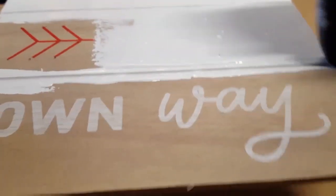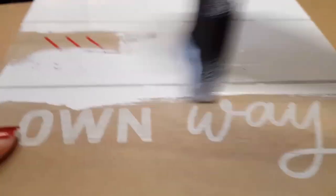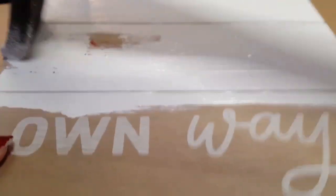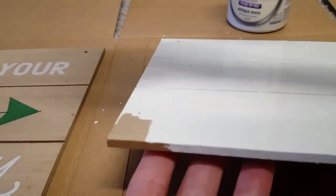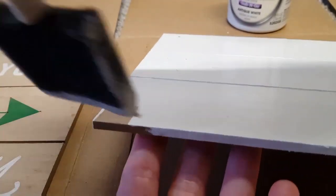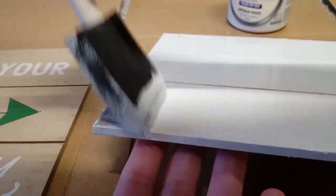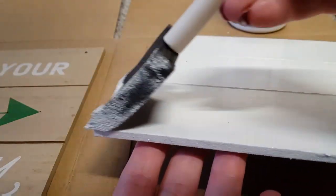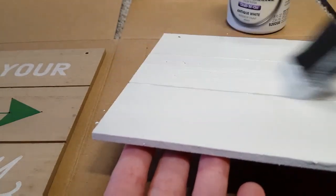You don't need to do the back. Once you get all your paint on, take your paintbrush and go all the same way, so the paint in the grooves of the wood is going all the same direction instead of up, down, sideways, or swirly marks. Be sure you do that with all your boards and let them dry for at least an hour or so.